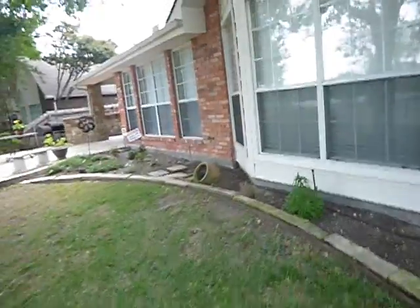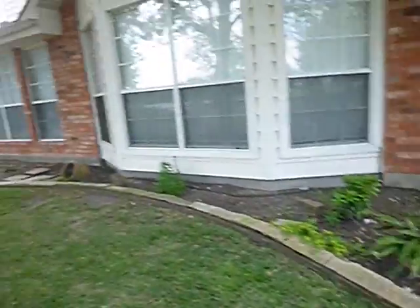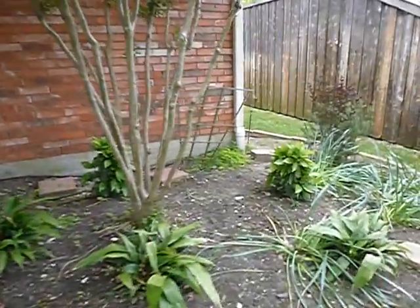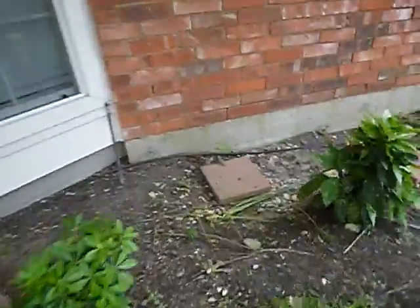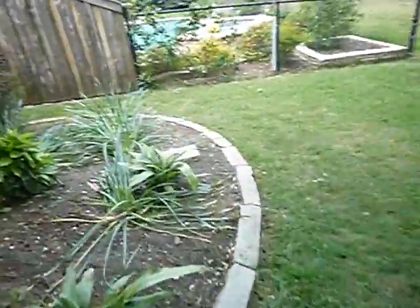What we've got across here with these stones has created a level drainage situation. You see these ends like this — this tells us it's a post-tension cable slab. These are called weep holes, and these are good things. Homeownership 101: all roofs leak, all walls leak. We want them to shed water faster than they accept it.